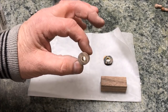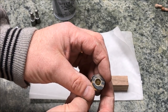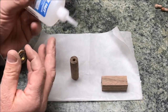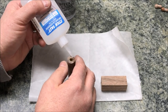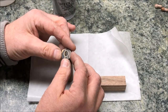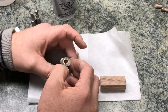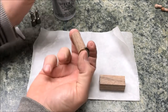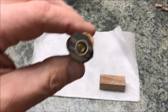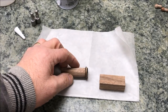I took my back blank over to the lathe and trued it up. Now we're going to take this 10 millimeter trim ring that we made and, by eye, center it around the 7 millimeter tube and glue it in place. We'll start by putting just a little bit of medium CA on here, center it up, and hold it in place. A shot of activator should help it dry. It looks like it's centered up real well. We'll give this a few minutes to finish curing and then we'll take it to the lathe and begin turning.